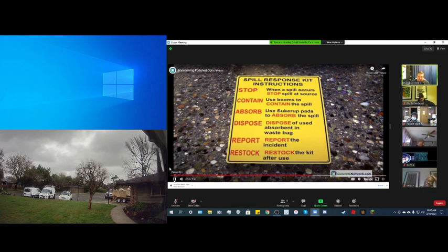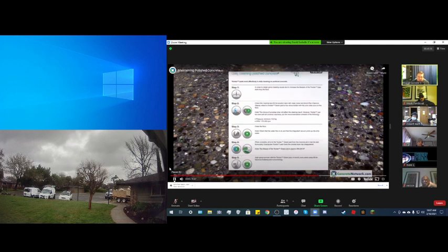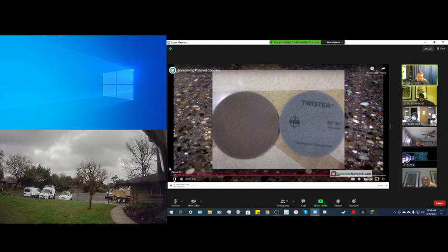Even in a residential setting, the same basic rules apply. Some manufacturers have recommended daily cleaning examples, such as the frequency and the type of pads and cleaners to use, like seen here. Also, an important consideration is the type of system your polished concrete contractor put down. Maintenance pads are not a one-size-fits-all. For example, if a guard system has been applied, 3,000 grit diamond impregnated pads are too aggressive and over time will degrade the surface. In this case, a system like you see here would be used, which is a super